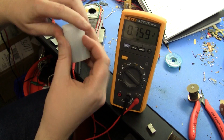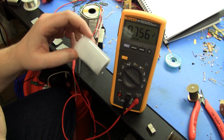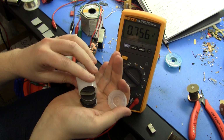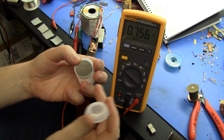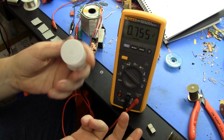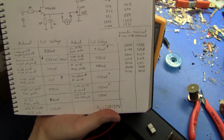In here is a whole bunch of cells for various different chemistries that didn't work as well as these. Some of them are 200, 300 millivolts relative. So some of them are actually fairly good though. There's some nickel ones in here, there's some aluminium manganese ones, there's some ones that are made out of galvanizing paint, sheradizing or galvanizing paint, aluminium paint, nickel paint, carbon conductive paint. I tried a whole bunch of different things, and those experiments are largely documented here, but there's some more ones that I haven't actually documented here.